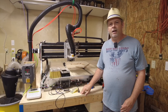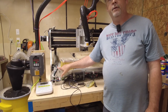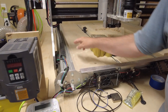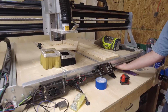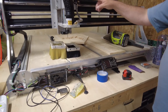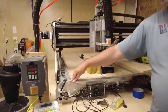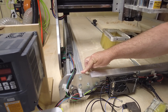Without further ado, let's get down to it and start with the frame components. The frame components were mostly bought from 80-20.net. We have an 80 by 80 extrusion that is 1,500 millimeters long down each Y-axis, and across the X we have a 40 by 80 laying on its side — the 40-millimeter side — going across the front, across the back, and one down the middle of the machine. Holding those together are some L brackets, and at the ends are plates — 3/8-inch aluminum that I created and cut with my woodworking machines and drill press.